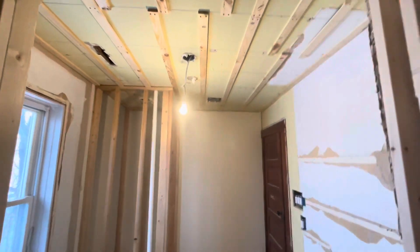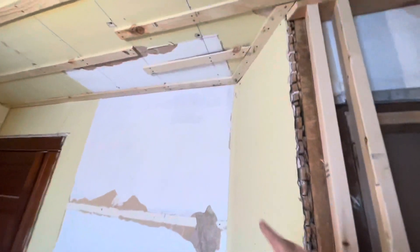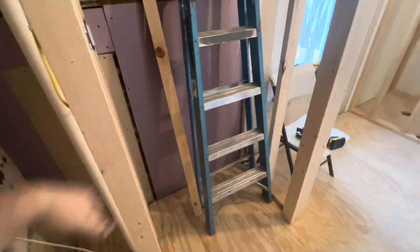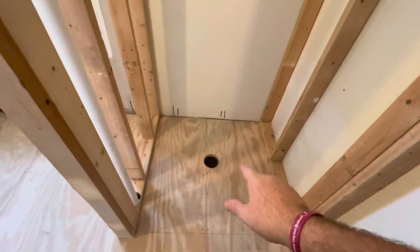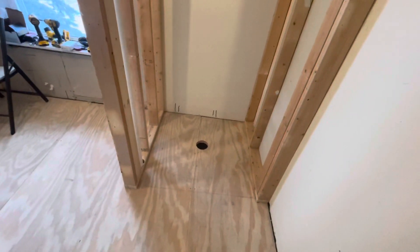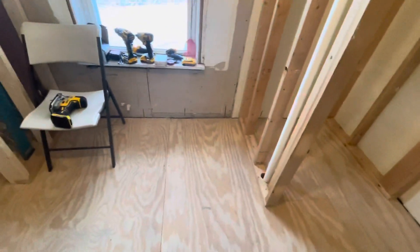I'm gonna bring up the shiplap and start doing that. I'm not the fastest worker in the world — been working on this house forever. Once the ceiling's done I'm gonna do the floor. The shower direction says you can put it straight on the vinyl, which is the best — you silicone it down, stick it down. Never done one like that before, but downstairs I put it on the floor and it worked out great. The tub sits on the floor too, so I'm not gonna cut those holes until almost the whole bathroom's done.